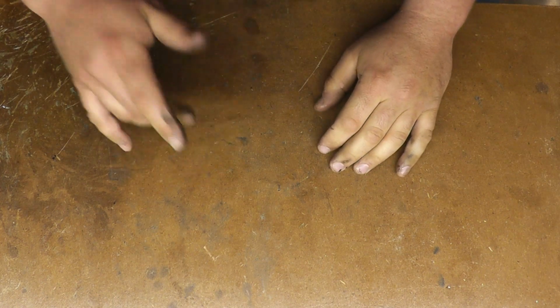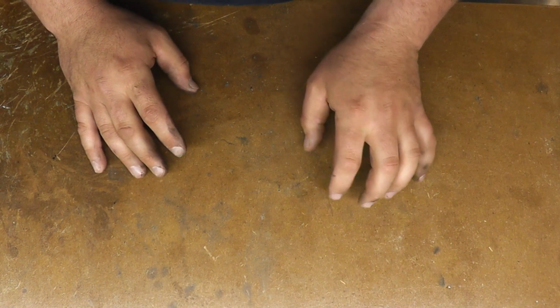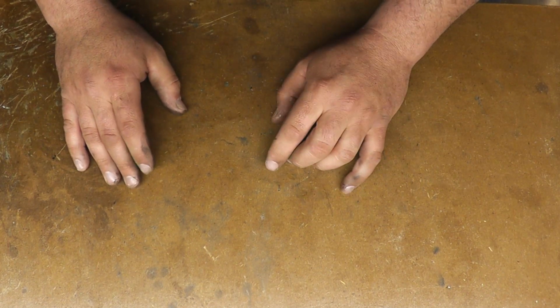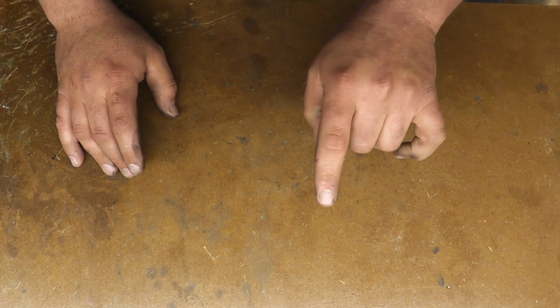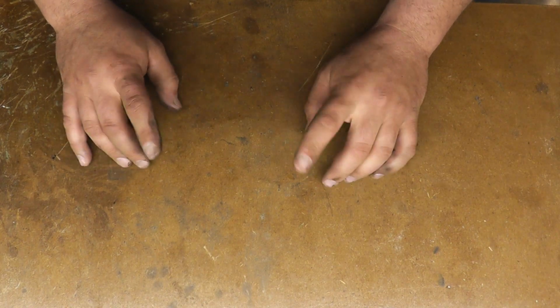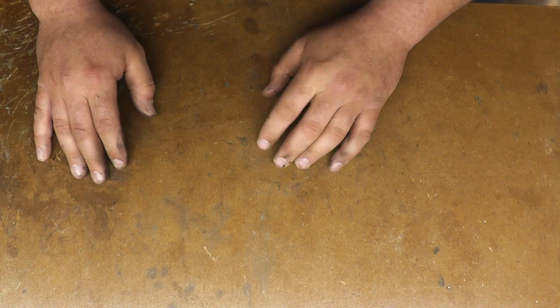So now another good example of just needless complication is Charleston units. Okay, Charleston units now have a keypad on the left-hand top corner of them, and it's all digital. And you have to have a special code to be able to enter all the programming. And if you didn't know, it's 0A. When you hit the set button in the middle, it's the 2 arrows, it says CUS, it's asking you for a customer number. Customer number is 0A1. Type that in, that'll allow you to change the temperatures, and will allow you to check the sensors and everything. Quick tip.